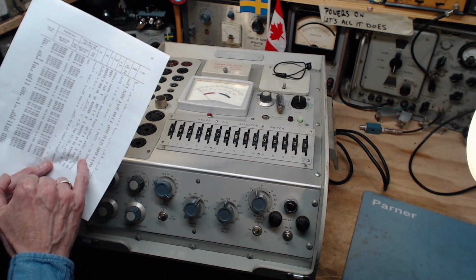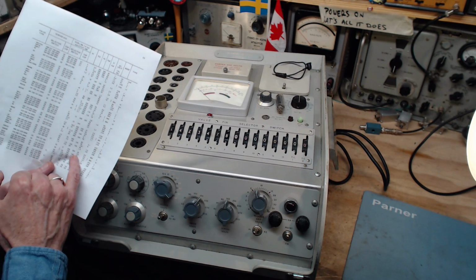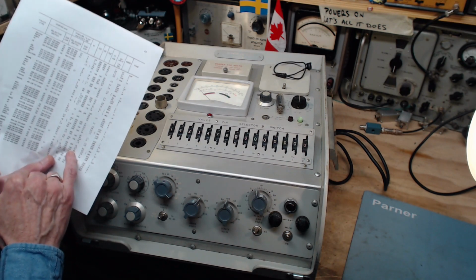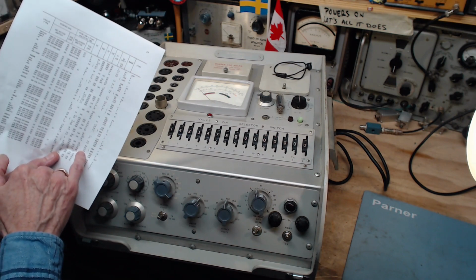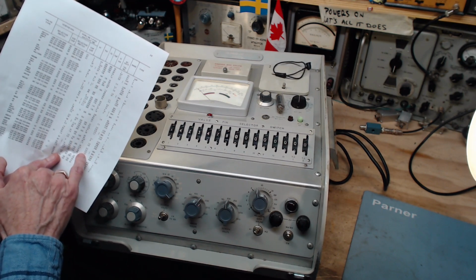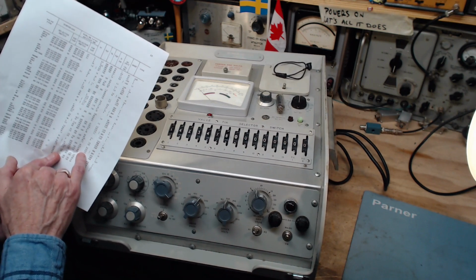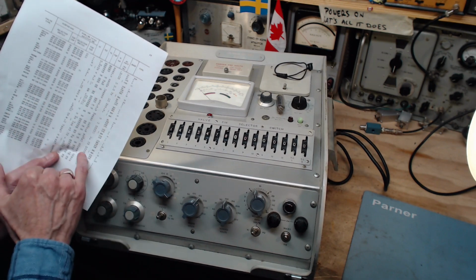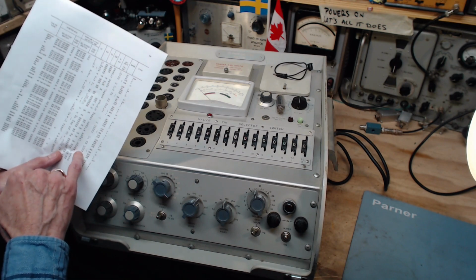So this says, so what does that? It says 41 for the IA in milliamps. 49, sorry, 49 actually, 49 milliamps. That's got to be a reading. The next number here is GM, in milliamps over volts. 7.5. That should be like 7,500, shouldn't it? So maybe they don't want to write all the zeros over and over and over here. So I think that's what's happened here. So it says 7.5, but it's GM is 7.5. You throw the tube away.